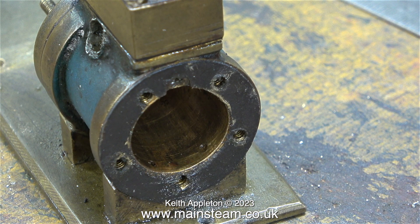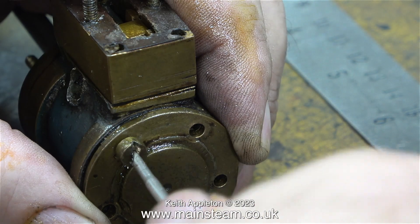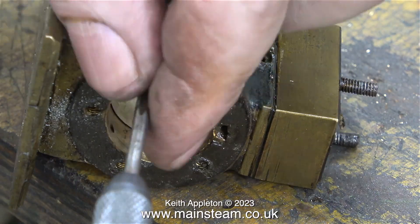This is the end of the cylinder without the piston fitted. The threads in this cylinder are not very good, or at least they don't match the actual machine screws used to hold the cover in place — it just rotates. Time to re-tap the holes 5BA.